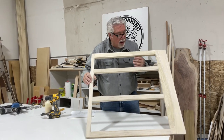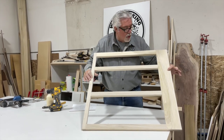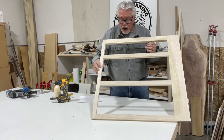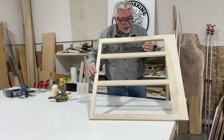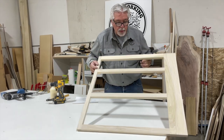Here's our face frame all done with our filler as part of the face frame. Remember — corner filler 3x3 to allow drawer faces to pass one another in the corner. Here's our face frame portion. Now to the table saw to cut the panels that this will attach to.